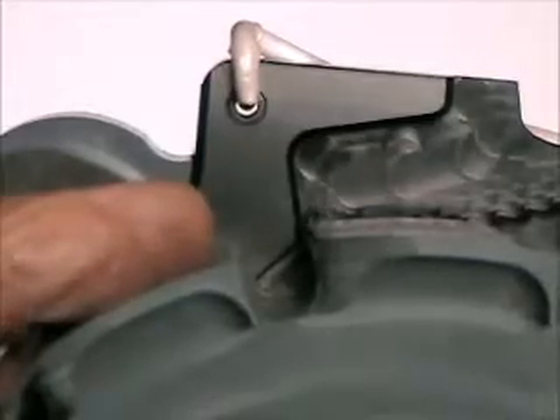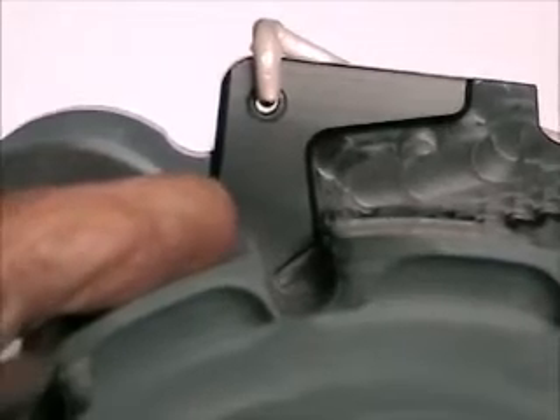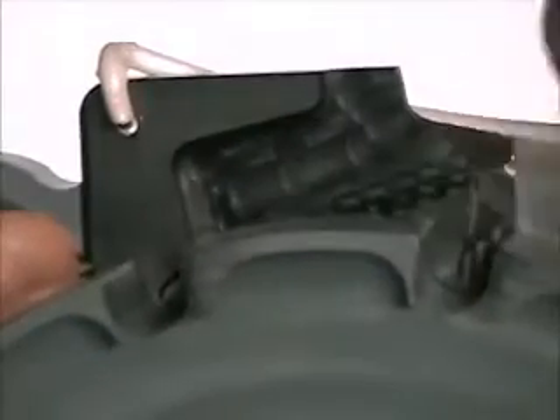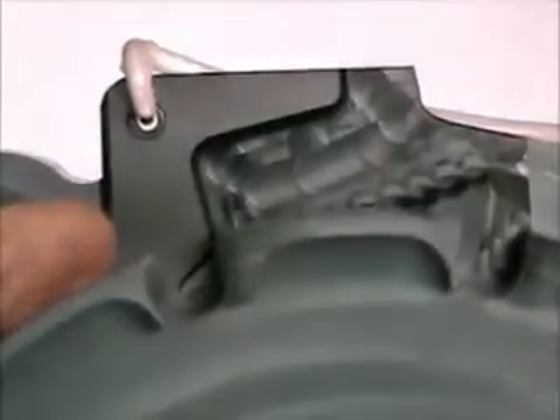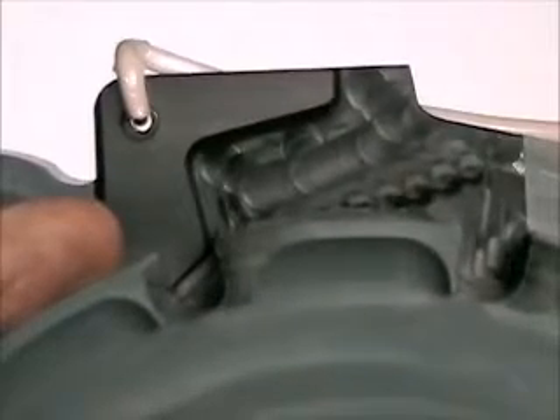Here you can see the tip lead-in slot of the nose guide. It doesn't quite hit the bottom of the collator plate slot, but it's fairly close to it. The cut-out edge is about even with the front portion of the collator plate. That's going to give a fairly large ledge for the bases of bullets to ride across, but the tips will be drawn into the main slot.